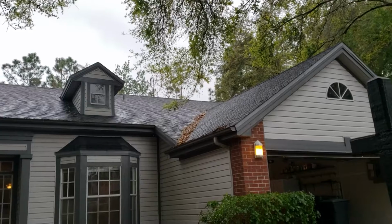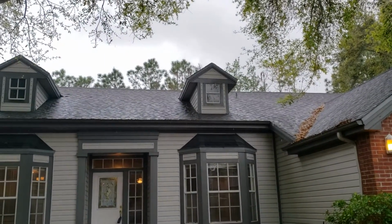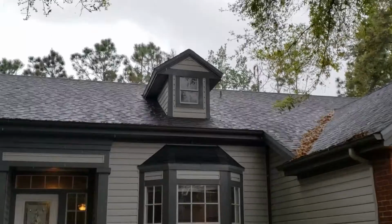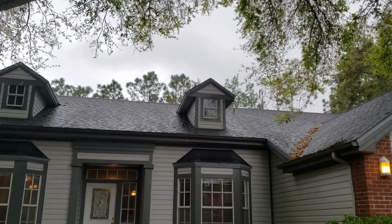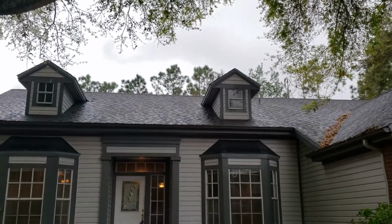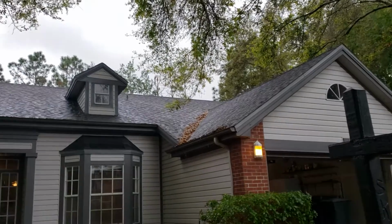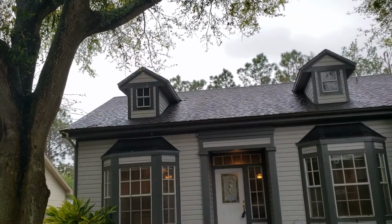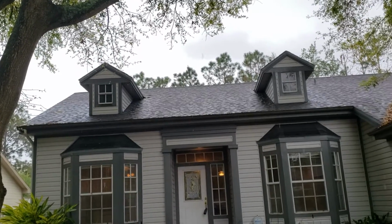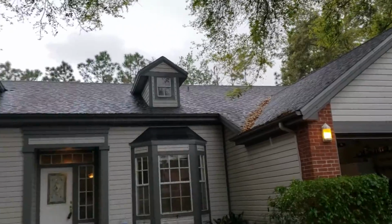There has been squirrel activity up on the roof. They have damaged almost every single plumbing vent boot up there. What they need to do is put these sleeves over those things. That would sustain them until they have to change this roof covering out. Because if you go to rip up some of that and put new boots up there, you're just going to cause a whole lot of problems. So screen over the boots. Yeah, just right over the boots.